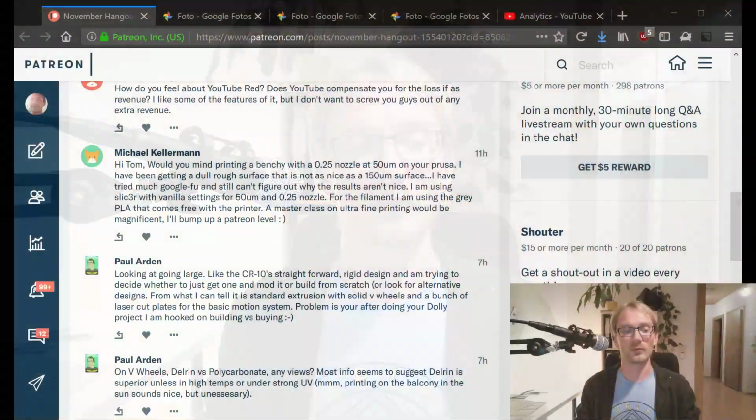But yeah, there is a certain limit to how low you can go. First of all, when it comes to mechanical precision, the Prusa Mark II obviously doesn't have the most high resolution z-axis, and when it comes to what your actual nozzle and extruder can do, there is a limit to what layer heights are going to work with a particular nozzle size. So typically, I don't go below a quarter of the nozzle diameter. So for 0.25, that would be, math, 75, a bit less, 62.5 micron layers. So you're right at that edge. For a 0.4 nozzle, obviously that would be 0.1 millimeters, so 100 micron layers. That makes sense. And also the other thing is your extruder, which isn't a geared version on the Mark II, is going to run into a resolution limit.